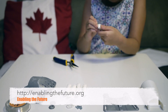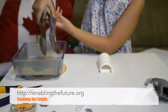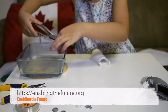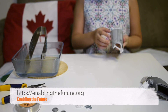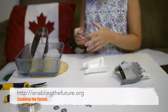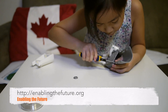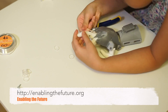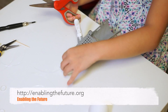Each finger is held to the palm by two pins. Next, we move onto the gauntlet. This part we will need to thermoform into a shape. We will need to soak the part in hot water to soften up the print. Then we lay it on the form and shape it. Once it cools down, it's ready. Then just attach it to the palm and add on the gripper box. The next step is to attach the rubber band that will pull the fingers straight. The last and final part is to string the fingers and tension them to the gripper box.